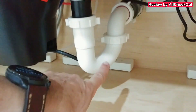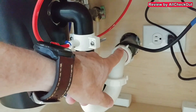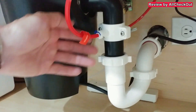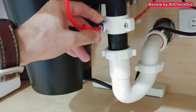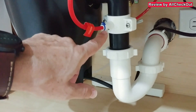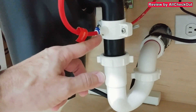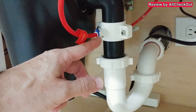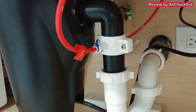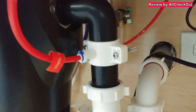The backwash drains after the garbage disposal but before the U-bend, and it's higher than the final drainage, so it will never be affected by standing water. The pipes are secured with horseshoe clamps — whenever you need to disconnect one, you pull out the horseshoe, push the white safety ring inside, and only then can you pull out the pipe. They are really nicely secured. We've had this installation for two weeks now with zero leaking issues.